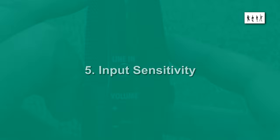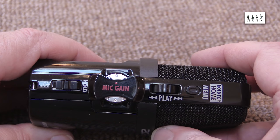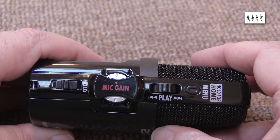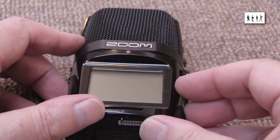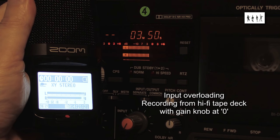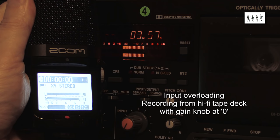Input sensitivity is an important concern. Most recorders with a common mic and line input socket provide a sensitivity range option — either via a setup menu or hardware switch — with a choice between mic or line, low or high sensitivity, or even a 10 or 20dB pre-attenuation pad. But that is not the case on the H2N. In practice, a regular hi-fi line output connected to this socket will definitely cause clipping even at a gain knob setting of zero, and professional high-output PA mixers will be even worse.